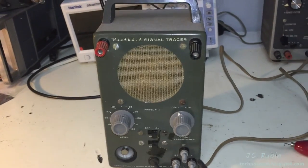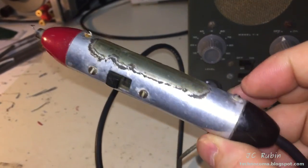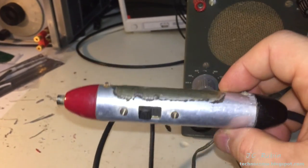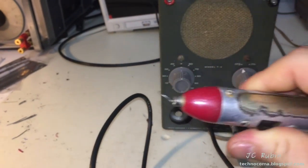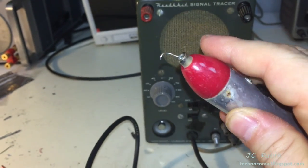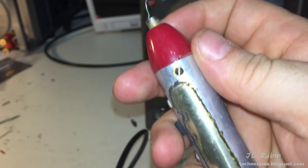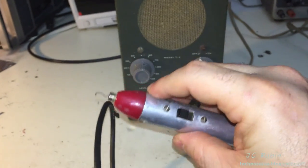So they're hard to find in good condition anymore. The probe looks worse for wear but the cable's in good condition and the probe appears in good condition — there's the ground clip. Back then the ground went straight to the shell, and this shell is made of metal, so beware. The needle at the end is missing, and I imagine that needle could be replaced — I could buy a crappy destroyed probe for like two dollars on eBay, replace the needle portion, put on a new label, polish up that aluminum, and it'll be running like new again.